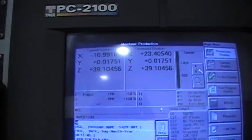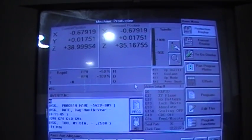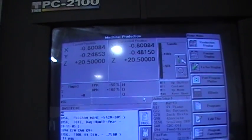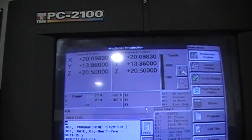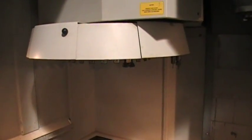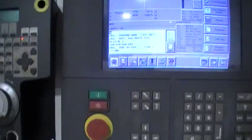All the axes are moving through the alignment process. As you can see on the readout on the screen, it's in inch mode. This machine has the super precision option installed on it, so you have an extra decimal place — on X or Y you have five decimal places. The axes are now aligned. Let's go to mechanical align for the tool changer — it should align itself. The whole machine is now aligned.